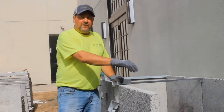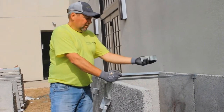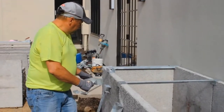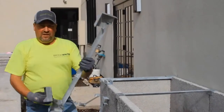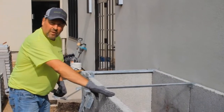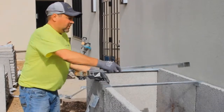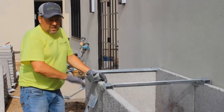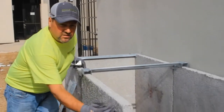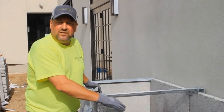Hi, we're over here at the 18-foot island. These are the brackets that we're assembling the system with. I'll go over it real quickly with you. This is a bottom corner, so the two panels fit into there. And then once you get the two ends, form a horseshoe, we put the top corner lock bracket on there, like we've done here. And then where your next straight run panel goes, you just put a straight lock piece in on the bottoms, and covered at the top, a straight lock piece there. We'll run that all the way into the end. If we have to cut, shorten this like we will here by 6 inches, we'll just take 6 inches off of the front and the back, pull it, and we're exactly the size of what they wanted here. So easily customizable.